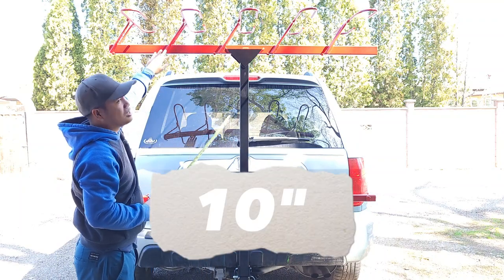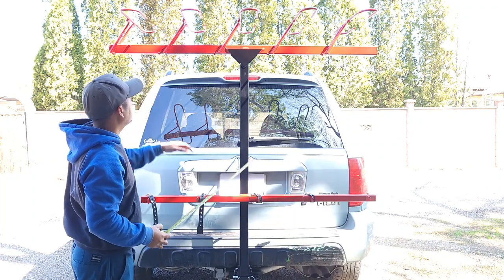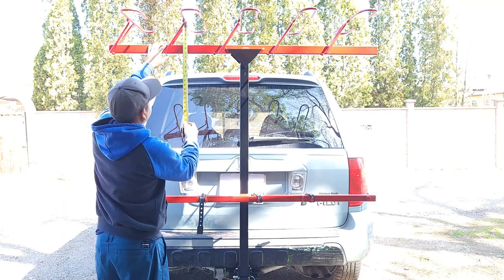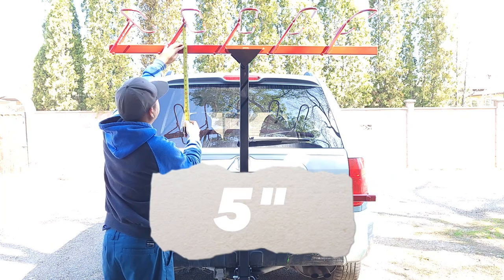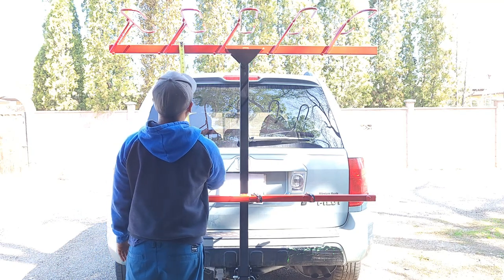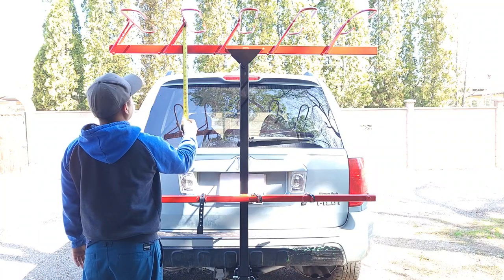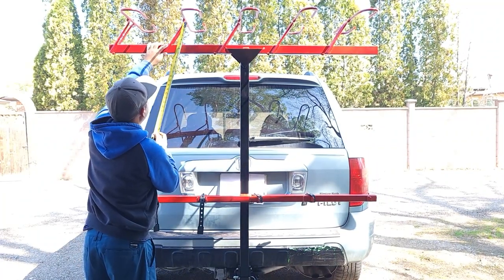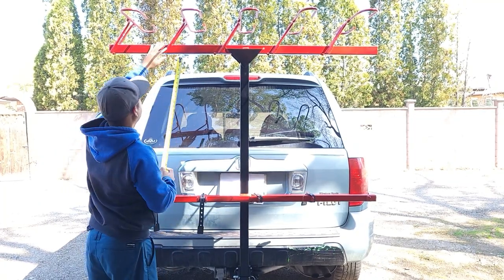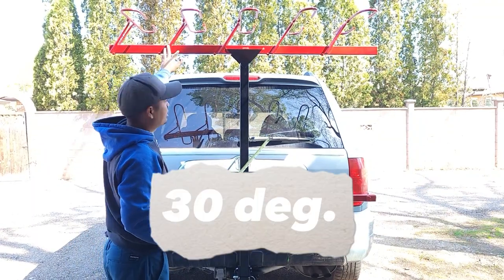This short bracket piece I cut at 10 inches long — thanks to my buddy who gave it to me. I mark it at inch-and-a-half and bend it to 90 degrees. From that bend point to the end it'll be around 5 inches height from the top to the bottom of the plate. The lean angle is 30 degrees.